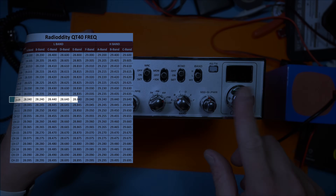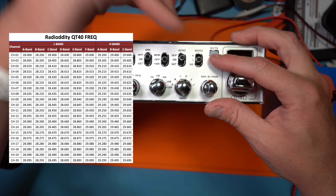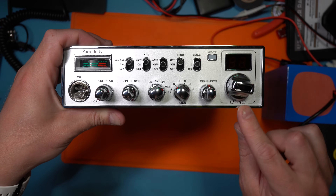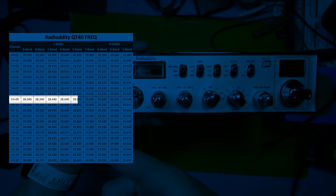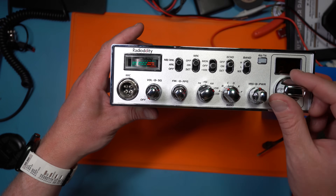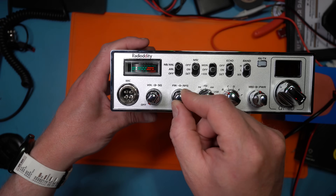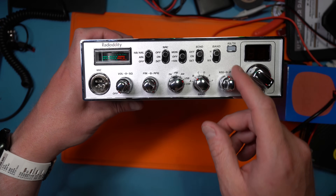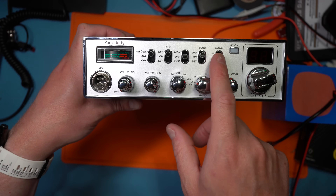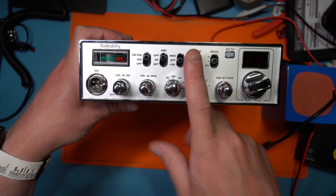For instance, if I wanted to be on 28.243 MHz, I would need to turn to the B band, then be in the low band — the low side of 28 MHz, down in the CW portion — and then use the channel knob to get up to channel nine. You have to follow a spreadsheet to find what you're looking for across high and low band. It goes in 5 kHz steps with the channel knob, so once you find the channel you think has a frequency on it, you then use the fine-tune knob to dial in further. That's a four-step process to find the frequency you want to use, and that's a lot.